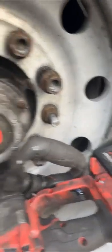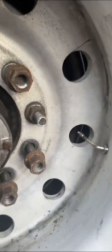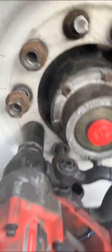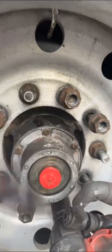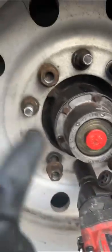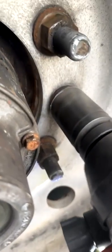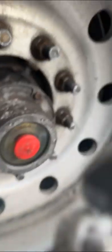It still does the job. I'll show a little trick — I like to do the cross pattern: tighten side to side, then make sure you tighten from the sides. When you're doing top and bottom there's too much weight and the tire fights itself; when you do side by side it goes in even. Last, I like to wipe all the anti-seize off the bolts.